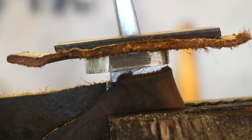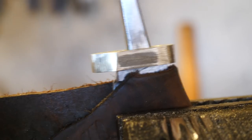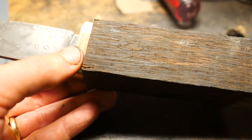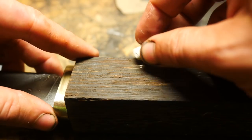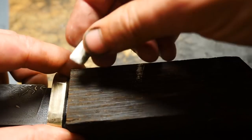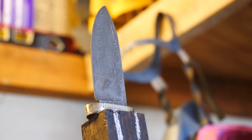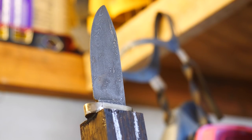I'm not going to go too crazy with the guard or try anything new there. I just really want to get it finished up and move on to the second knife, our San Mai version, where we should have a good edge because we're going to use 1095 steel for the entire edge and sandwich some good steel in there.